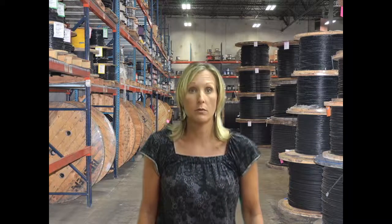The cable construction of the 9207 is in the twin axial family. 9207 has electrical performance categories that work within different system design frameworks. It is constructed with a pair of 20 gauge conductors and a full tinned copper braid shielding. The outer PVC jacket is rated 75 degrees centigrade and is rated for 300 volts.